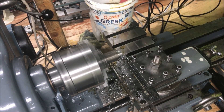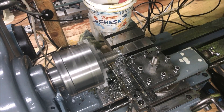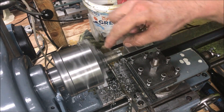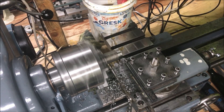I've managed that too. So let's try 2mm in. Then I'll go into this edge here also to feed in. I just cleaned up the inner there — going a little bit towards the stock means it should be easier. Then I'll do 2mm in, or actually 1.9mm as I explained.